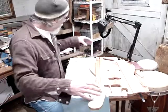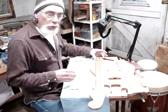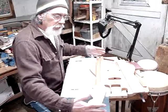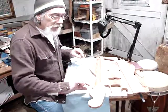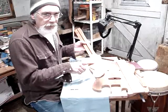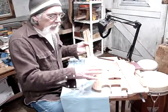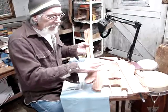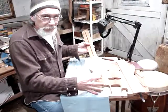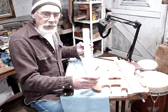I had a piece of mahogany that was about two and a quarter inches, which is the width of the heel of my neck. The headstock is kind of a copy of a 70s Stratocaster — it's wider than what my wood would have been, so I took some scrap pieces I had left over and glued those to the sides to get the extra width for the headstock. This is normally what's done in most guitar factories and neck making.